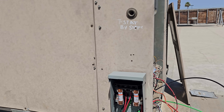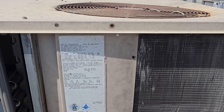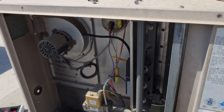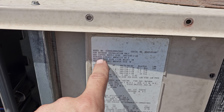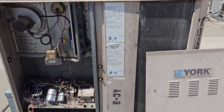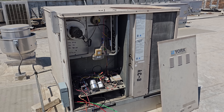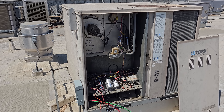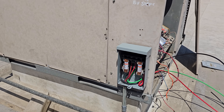Realistically, they need to change this unit for sure. The minimum circuit ampacity on this unit is 48 amps, maximum circuit breaker size is 70 amps — which blows my mind for a 5-ton. That's just a unit from the 80s, I guess. We have a 60-amp breaker at the panel and 60-amp fuses right here. Realistically, I don't think we're going to run at 48 amps — probably going to run at 30. It's just one 5-ton compressor, half-horsepower condenser fan motor, three-quarter-horsepower indoor blower motor — it might run in the 30s on a hot day. They should have just pulled number 6 wire to this unit.